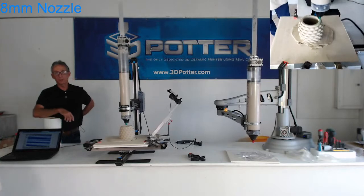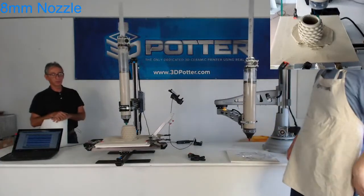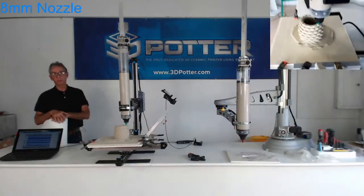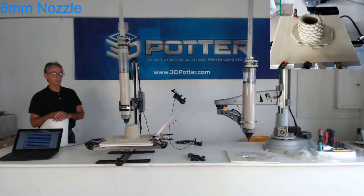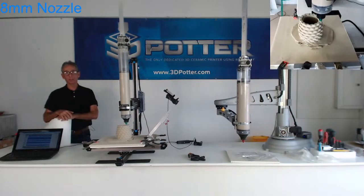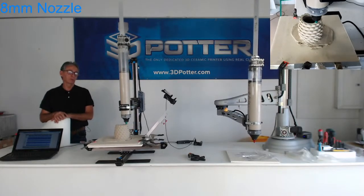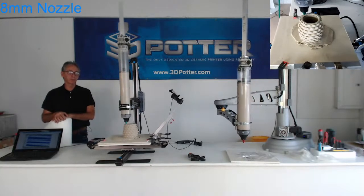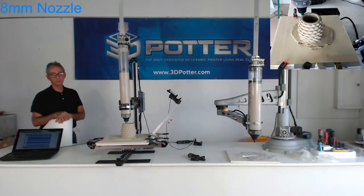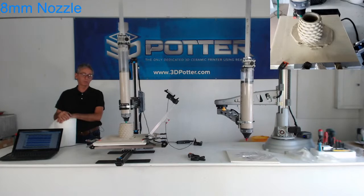We also have Scara printers for industrial applications. So we're getting larger, and we're able to print small habitat and concrete structures. We have a couple of new pumps coming onto the website. We also have a new track system for the Scara. So we're getting to the point where we can increase the work envelope, on the X, to quite large, 30, 40 feet, and the diameter can be close to 15 feet. So we're able to start producing large structures.